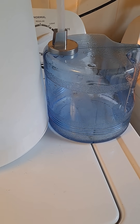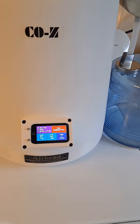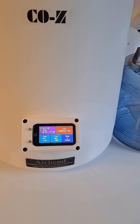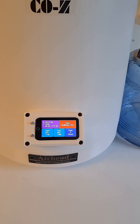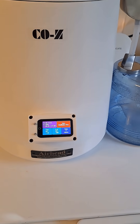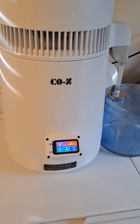The calibration is complete on this one. It took a correction factor of five to get it dialed in. Then I started a mode three distillation run. It hit operating temperature about almost 15 minutes ago, and I charged it up with two quarts of 140 proof brandy. So I'm just going to let this thing go until I get all my brandy back.